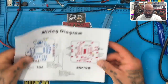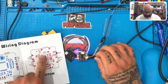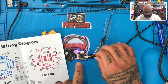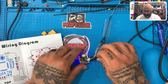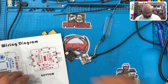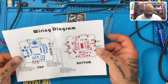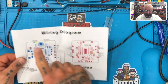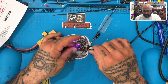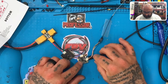Now here's the manual on this. If you look at this manual, the manual is talking about the board sitting this way. Here's your OSD right here, here's your receiver. It says TX2, but it's wrong — this should say TX3. This is a mistake right here. So that's going to be UART3. This is UART2 over here, which is going to be on this side of the board right here. They've kind of screwed that up with the manual.